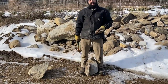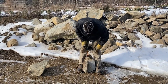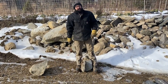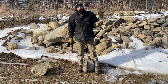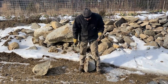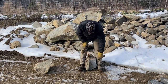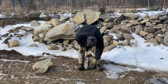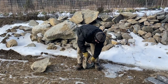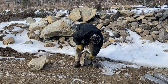One of the other things this chisel is great for is if you have stone that has an existing crack in it. This is kind of a piece of granitic boulder — this is not normally a tool you'd use for dressing a granite boulder, because that fine angle means the carbide is going to get damaged if you just start trying to trim into granite. However, when you have an existing crack — and this one's nice and visible because this rock had been sawn with a saw — sometimes you can just get it stuck in or placed on an existing crack and have great success splitting.